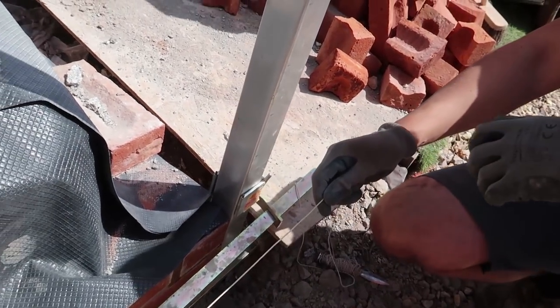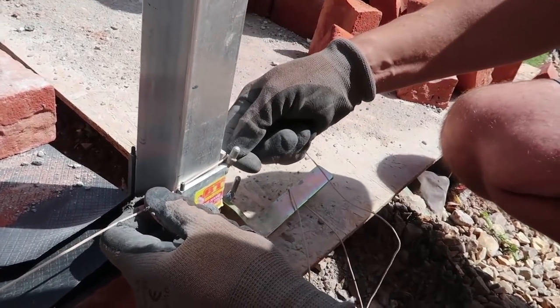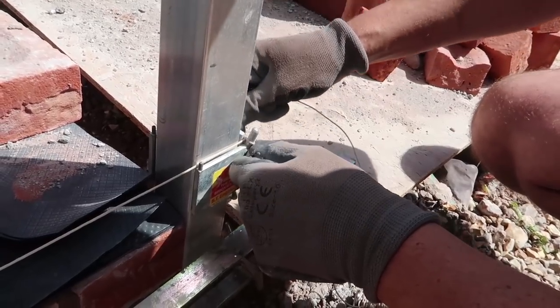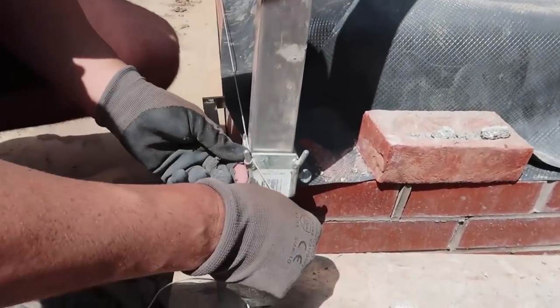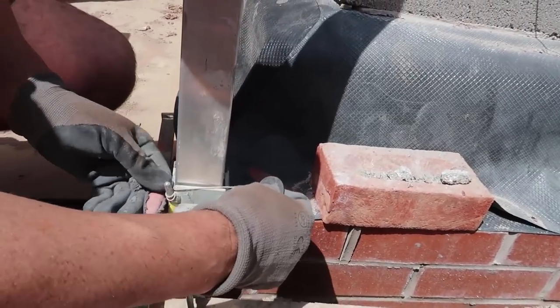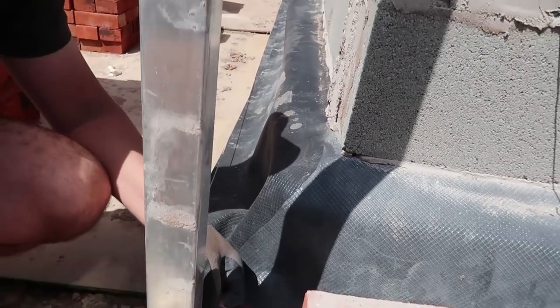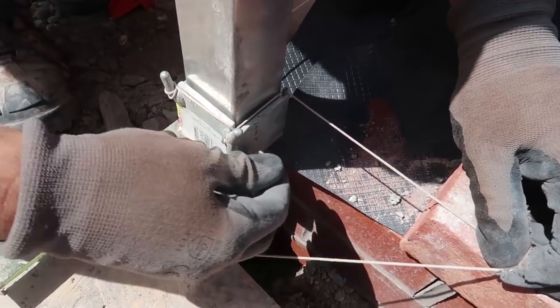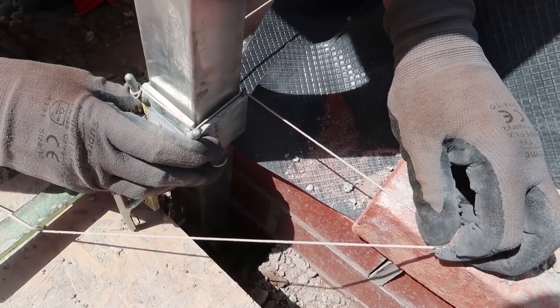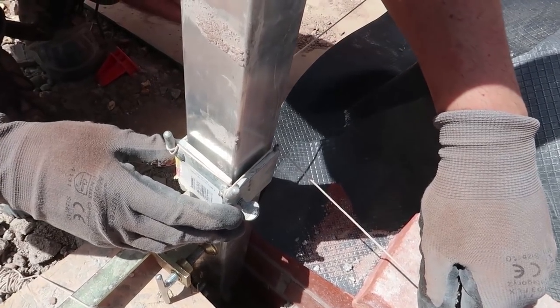Oh — that's come off. But basically what happens with a dory block is a line fires through. We wrap that there like so, come round here like that — same thing — figure of eight, and then it clips round this little pin here. And it allows you to fire your line back down there. Now that is awesome. And it's just a case of — you unscrew it, and then you lift it up to your gauge points every time you go up a course. Fantastic piece of kit — and that's what you call a dory block.